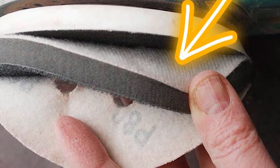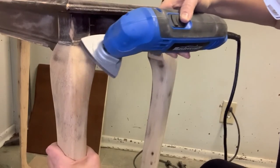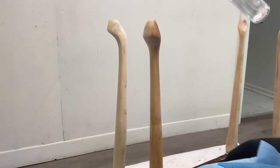If you're interested in trying these sanding pads, I'll leave the link in the description below. To get these legs perfectly sanded in all the corners, I used an oscillating tool with an 80 grit corner sandpaper. Then to smooth out the legs and prep them for stain, I moved up to 150 grit and then hand sanded with a 220 grit.